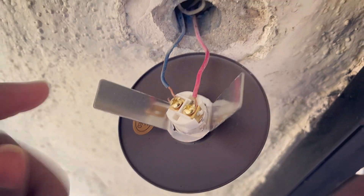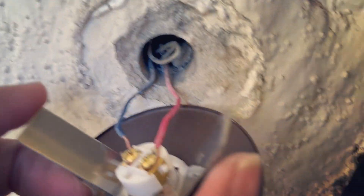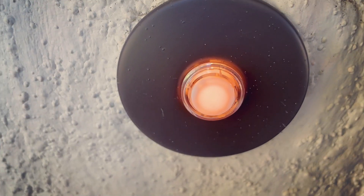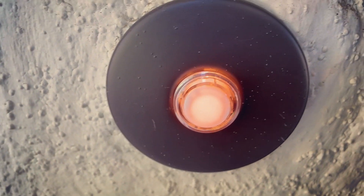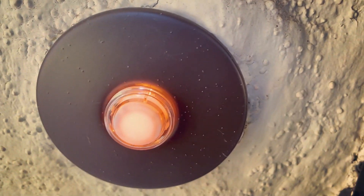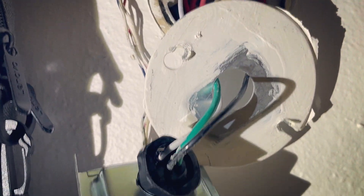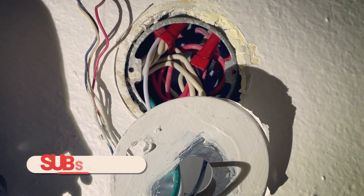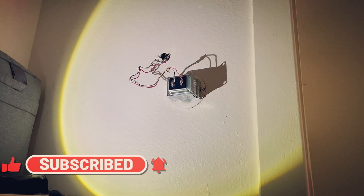I'm going to close these two wires together like this and push them through that hole right there. I turned on the power and as you can see the button is lit up, so the power is back on. Here is the moment of truth — did you guys hear that? We are successful! We did it. So we know that the doorbell works. Now I'm going to finish putting this all back to the wall, raise the screws, and we'll be all finished with this project. If yours is in a closet, that's how it should look when connected.